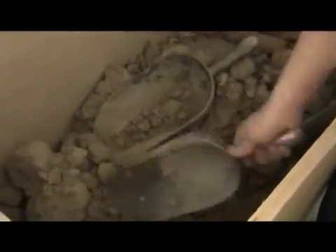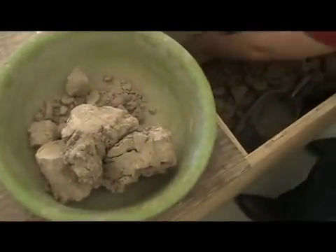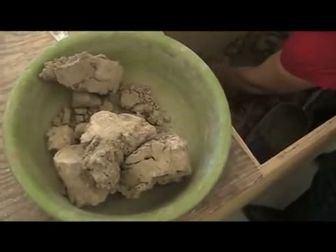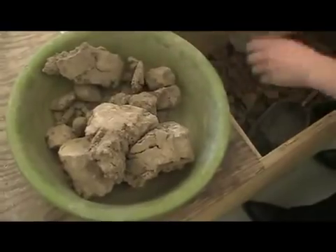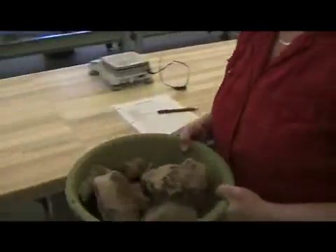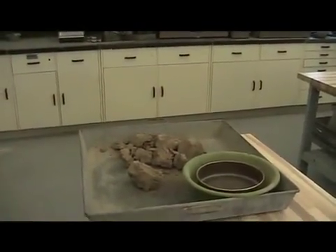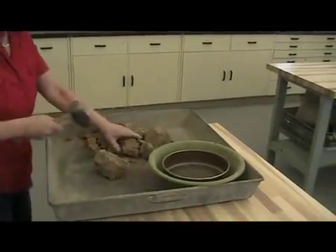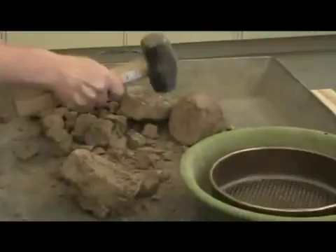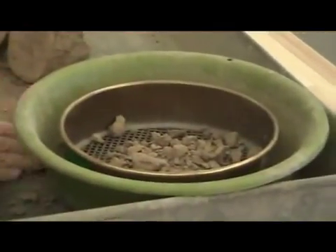This is the soil we'll be using. In the real world, the sample will be brought in and dried overnight in the oven. We'll take the mass of that as it's ready. We'll need a hammer to break this up into pieces that are small enough to pass through the sieve.